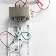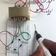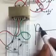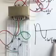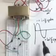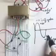Now let's see theoretically how the full wave rectifier works. As we all know, alternating current consists of cycles — a positive half cycle, and then it immediately reverses direction followed by the negative half cycle. For the first tapping, when it is in the positive half cycle this will be approximately positive six volts, and for the negative half cycle this will be another six volts.